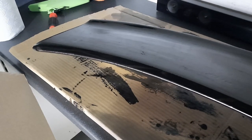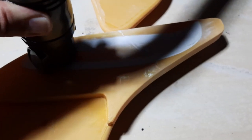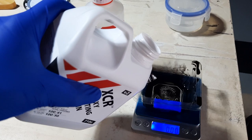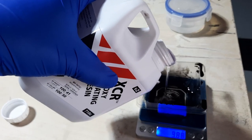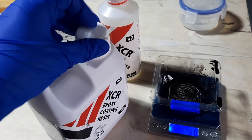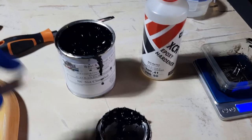What we've done here is to apply a special top coat resin which provides a lovely interface - it's very glossy and can be polished up ready for taking molds off the parts. I've been making some efforts to introduce some better engineering interface to fill up all the gaps, so I've used a bit of body filler on the end plates and now I'm getting ready to give things a coat. Here is the epoxy coating resin - it's mixed up much in the same way as polyester resin, you have two parts that you mix together, and in this case I'm adding some black pigment so it's more visible once applied to the part.